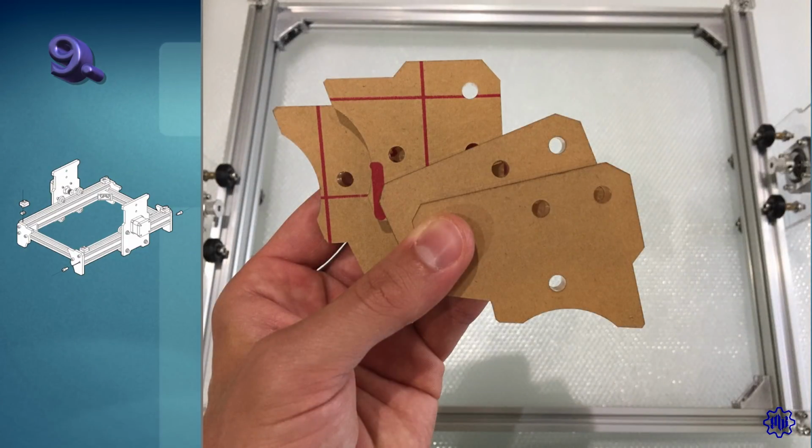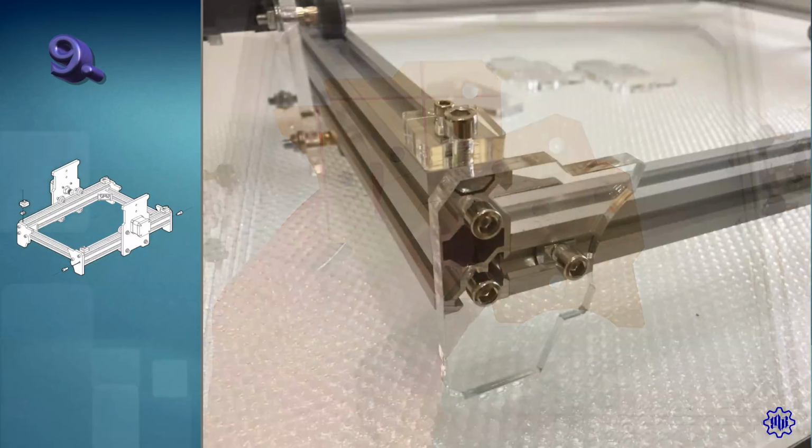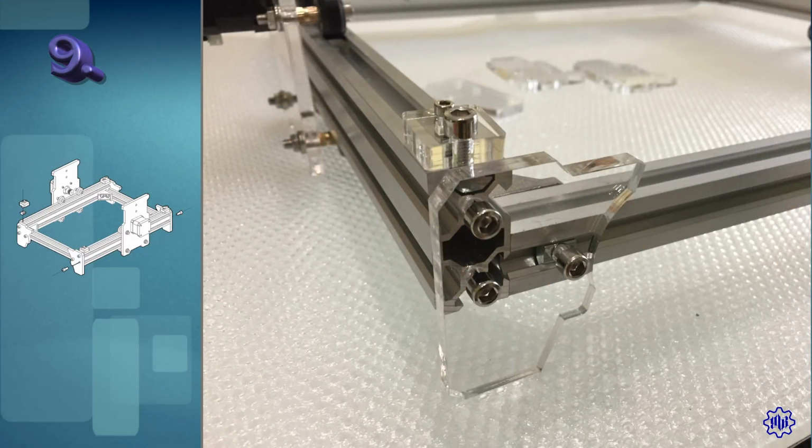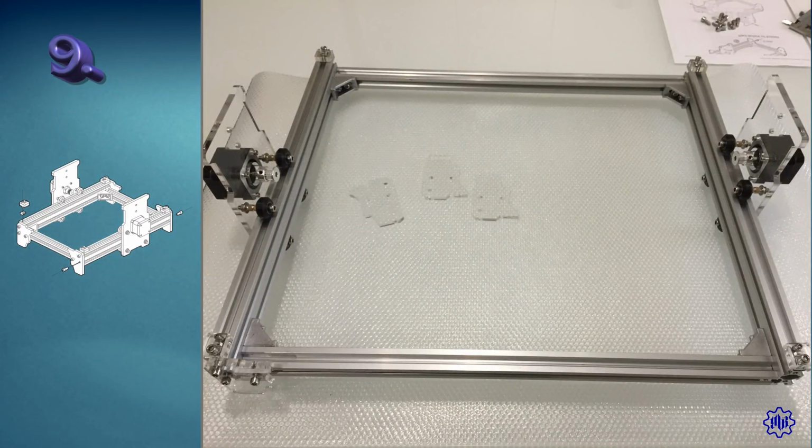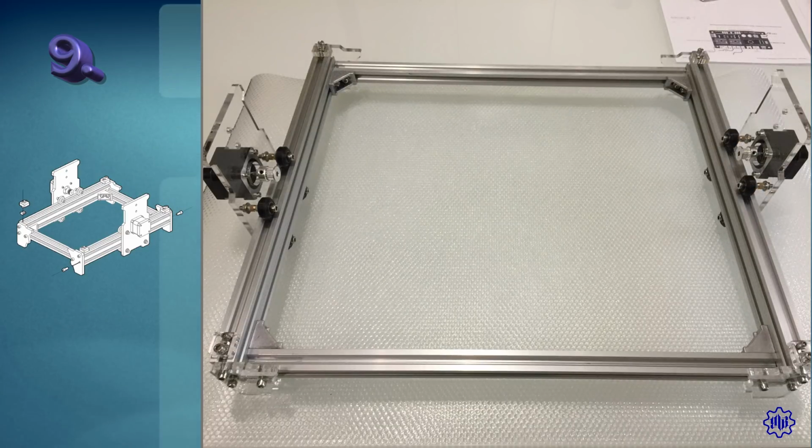Now, let's go to the plexiglass legs. They shall be fixed to the 4 corners of the supporting structure by 12 M5 by 12mm screws. For each leg, 2 screws will fasten to the double aluminum bar in the threaded holes, while the 3rd screw will clamp to the T-nut already positioned earlier. We also set the remaining 3 support legs. Perfect.